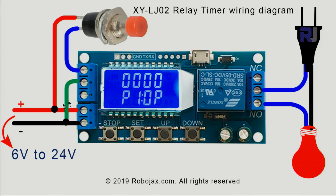If you need a negative trigger, instead of connecting to positive connect it to negative and that will be a negative trigger. If you're triggering from an external source rather than this push button, the negative and positive of that external source connect to the respective trigger pins.